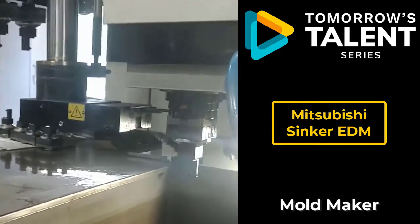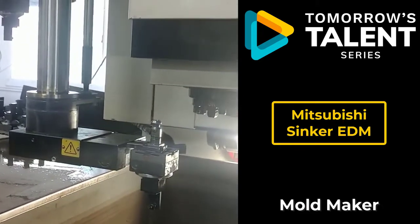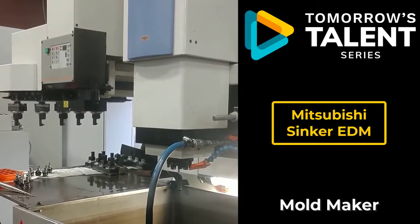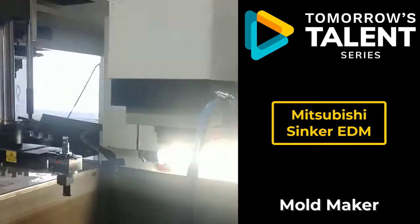Sinker EDM is typically used when you can't CNC mill something. The reason for this is often a feature is hidden where you can't get an end mill and cut the material, or it's extremely small where you'd have to design an electrode and burn it.